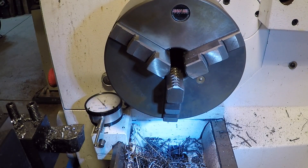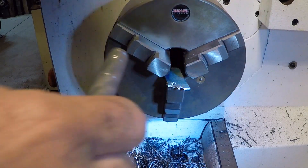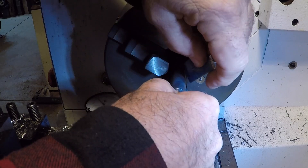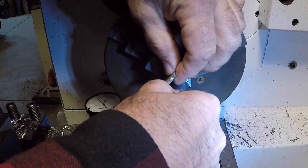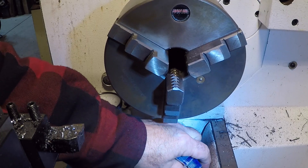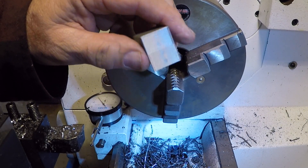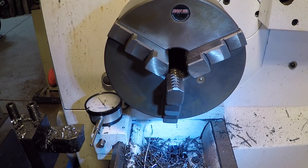Now when I had the pieces of aluminum, I had to rest a piece here and then put the piece in like this and kind of balance that aluminum. Then I'd take the other piece like this, hopefully it would stay in there, then take the third piece and jam it in — and you can see it's not holding and it would fall out. That's the idea of making those 3D printed ones. Also, I made these a little under a millimeter thick — you can see there's an indent from the chuck just by using it, so I may have to make these a little thicker, but we're going to try them the way they are.